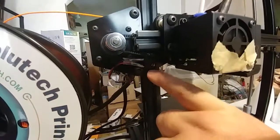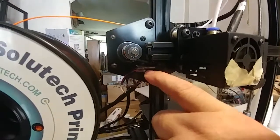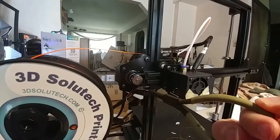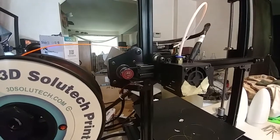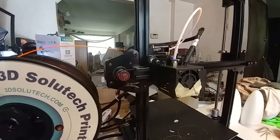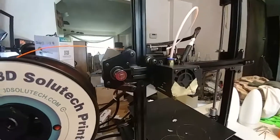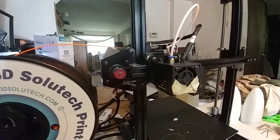One other problem: this contact for the limit switch touches this bolt, so you physically cannot insert this plug — it does not work. What you have to do is take a pair of pliers, grab that plug, and bend it up at an angle so you can insert it. An easy factory solution would be to have employees pre-bend that before shipping — just take a pair of pliers and pre-bend it up at an angle so the plug can be inserted without interfering with the bolt.